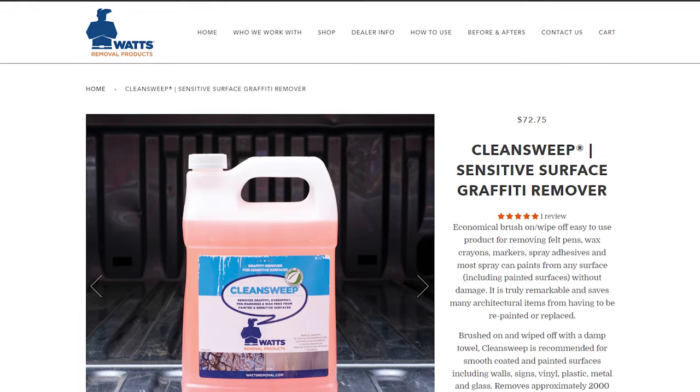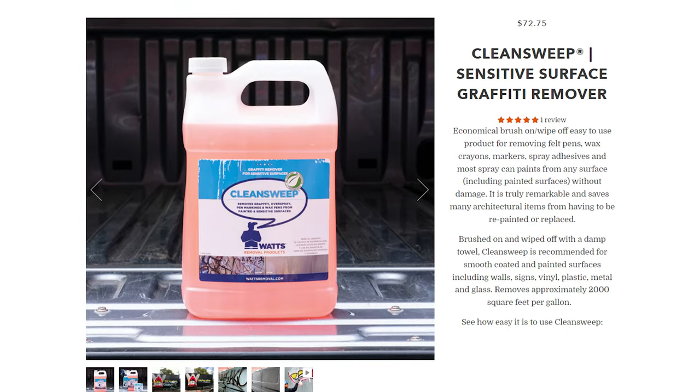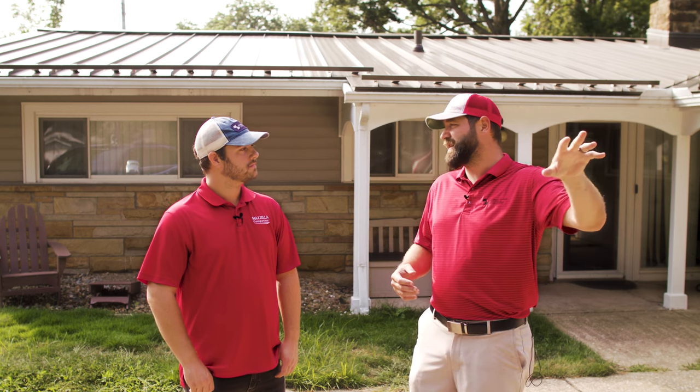What about tougher stains — maybe paint overspray or adhesive? There's a product called Clean Sweep that has been affiliated with Sherwin-Williams or Valspar for several years. If you had your gutters painted and there happened to be some overspray, you can get this Clean Sweep product and it'll scrub fresh paint or paint that's been on there a while. However, it will not corrode your factory baked-on finish. If there's overspray, a touch-up issue, or even if you left PVC or plastic on a flashing too long and the adhesive breaks down, it acts like a Goo Gone and helps clean that stuff off too.